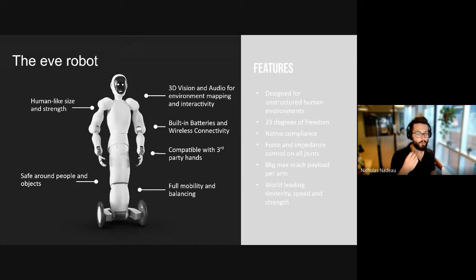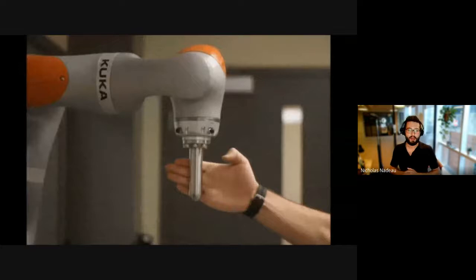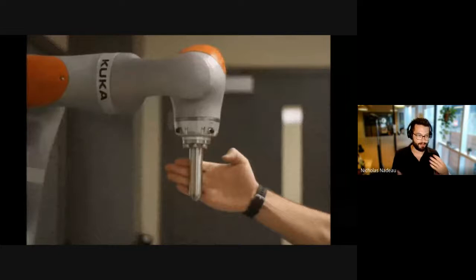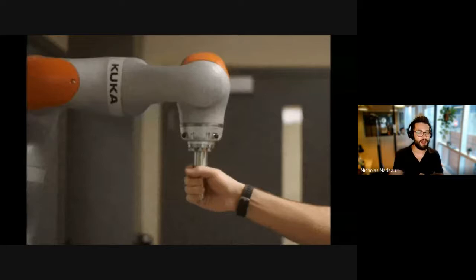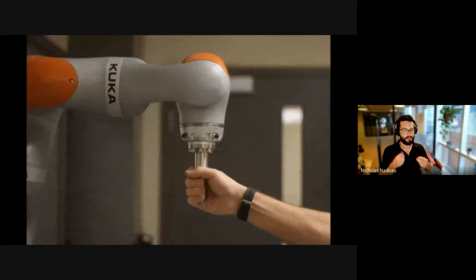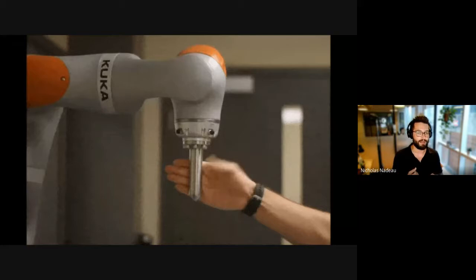We believe that the motors that were already on the market weren't good enough for physical human-robot interaction and collaboration. And so compared to, for instance, a KUKA LBR, a lot of your industrial robots have very large transmission ratios. So while we're able to do impedance control and force control with these types of robots now that they're filled with sensors, there's a high reflected inertia due to the high transmission ratio. So that's really great for precision and stiffness-based tasks. But when you're trying to do this impedance control and using your torque signal back from your end effector to get your compliance, it has low bandwidth and can't really keep up all the time with human interaction. So it doesn't feel natural.